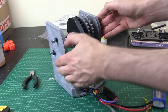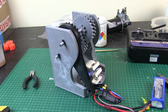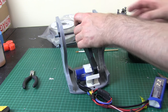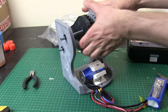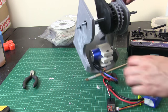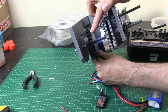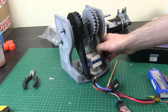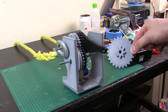I've assembled it — it's the most awful noisy gearbox ever. I've got a series of grey gears and then a black gear with a lever on it. My motor driver doesn't have reverse, so the lever gear can slide up and down and clutch with the final small gear. Running it without the handle: it's extremely noisy and rattly, but it'll do for testing torque. At full speed, I can't actually stop it with my hand. It skipped a couple of gears, and you can already see damage on this black gear.